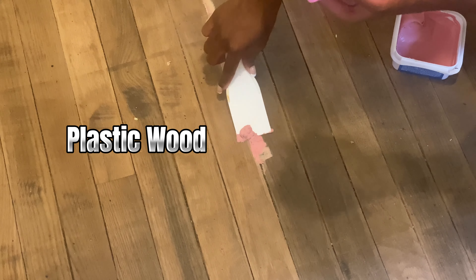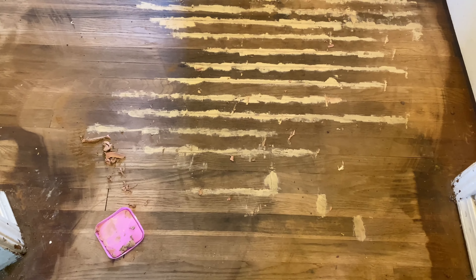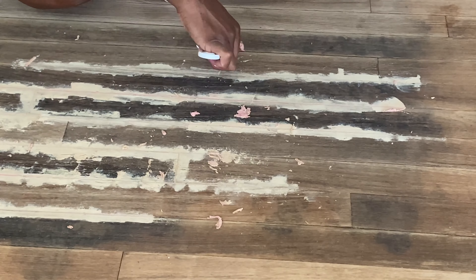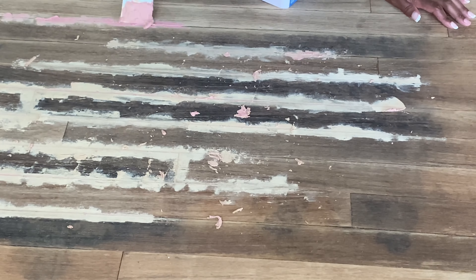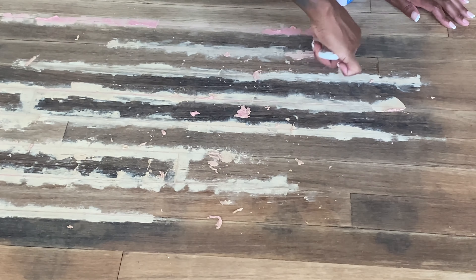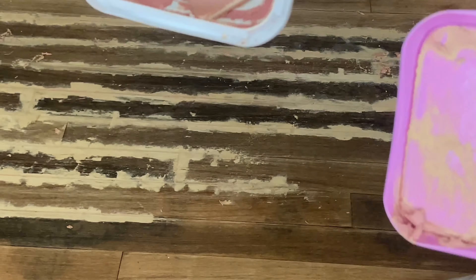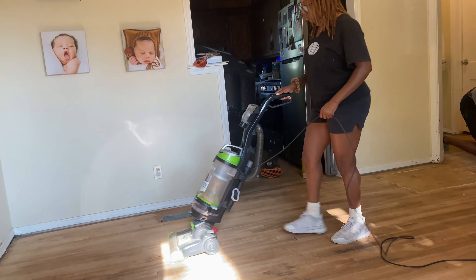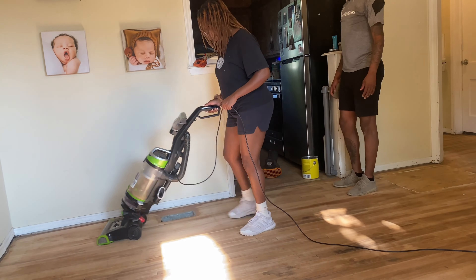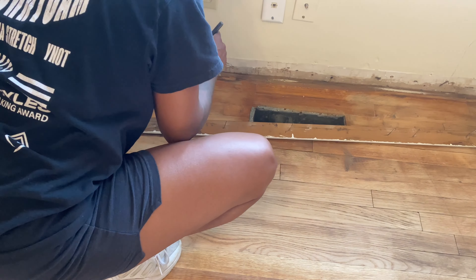This is plastic wood — not for the wall. Some people are going to hate that I did this, but the gaps were huge and I wanted to fill them. Honestly, I wish I had just used sawdust mixed with wood glue, because that stains a lot better. Here it is after all the sanding, and now I'm vacuuming up any remaining sawdust.